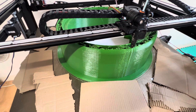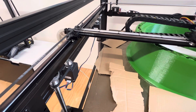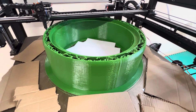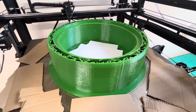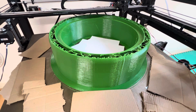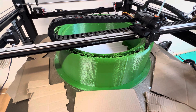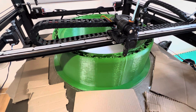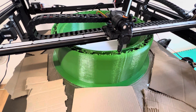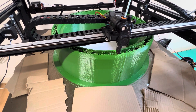The other thing to add is that I've really tightened up the Y-axis belts, since I'm not running particularly fast, and the closed loop stepper motors are handling that fine — they're still barely getting warm. I've had a couple of events where I pushed the acceleration for travel moves way too high and the closed loop stepper motors lost their position and started fighting each other and shooting off. So I've turned the travel speed and acceleration down.